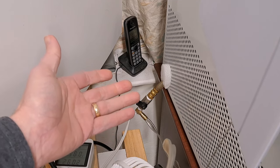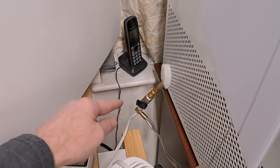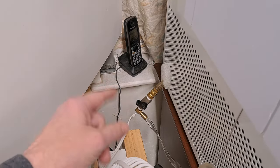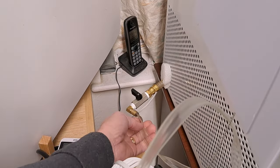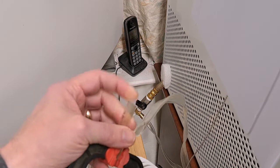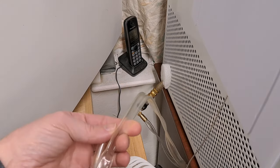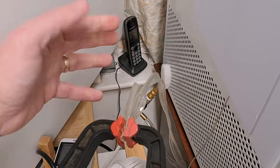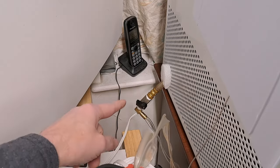So, at least to the people that have wanted us to have a vacuum leak, now we can finally try taking that valve apart and cleaning it, and showing the alternative that I've considered since we first got a freeze dryer, which is to eliminate the valve completely and just put a rubber stopper in the end of the hose with a hose that is stout enough so that it doesn't collapse, kind of like this hose here. When her machine is done and we start doing some stuff with it, I'll come back and show you what we're gonna do with that.